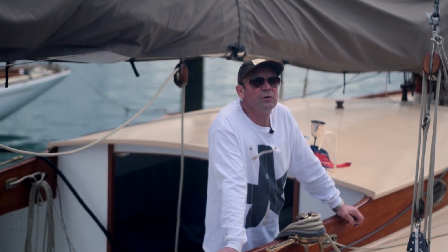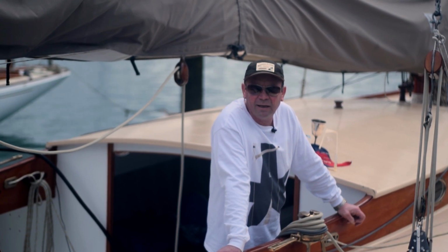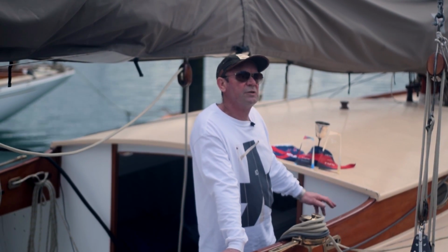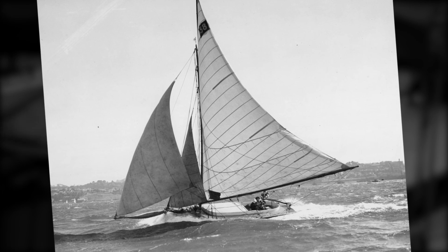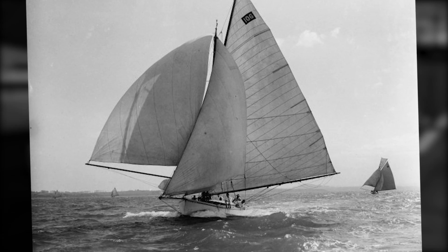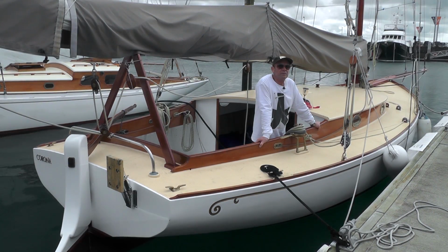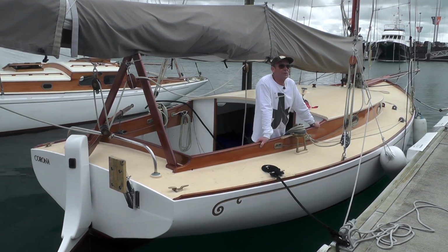They have a centreboard, they have a big barn door rudder, as you can see there, and they only draw a fairly shallow draft. This one's about 3 foot. And then you've got to drop a centreboard down, and then you have this massive sail power, in this case 900 square feet, on a 26-foot boat. And it was built for a fellow called Ron Nunn and his brother. And they campaigned it for about 18 years, and it never lost a race.